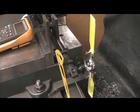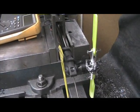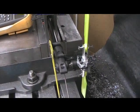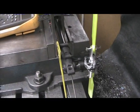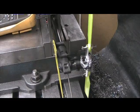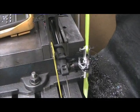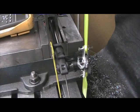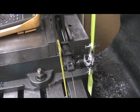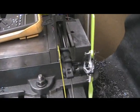You can see there that the actual force to move it from center was about 5 ounces. The reason that's a little higher than normal is I'm starting to adjust the weights to be a little bit more towards being neutral on returning. So it took 5 ounces to push it out, but when I took my hands away the actual blades would stay put, so there wasn't a whole lot of force trying to return them. I thought it's better to have a little bit of force constantly working against the servo in the direction it's pushing, rather than have it totally neutral and have all the play in the tail rotor system start to show up as a regular tail rotor response. That 5 ounces both directions is about the max — but considering we were at 40 before, that's a whole lot less.